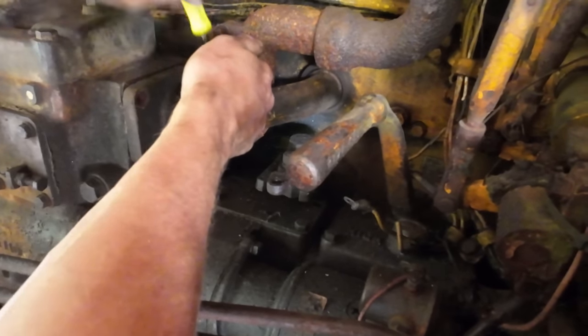It's perfect. Basically, you just need to make sure that this thing actually seals up good and tight, because if you had any leaks in here, the intake from the diesel could be drawing air through the dirty exhaust of the pony engine. So we got that face nice and sealed up. You can see through all the way down to the end there. There's stinking mud daubers filled up every hole on this thing. I already blew a bunch of them out, but there's another one filled. I gotta go hit those with the air compressor.